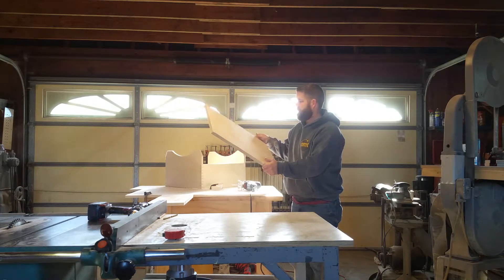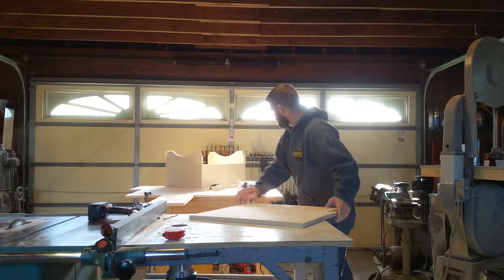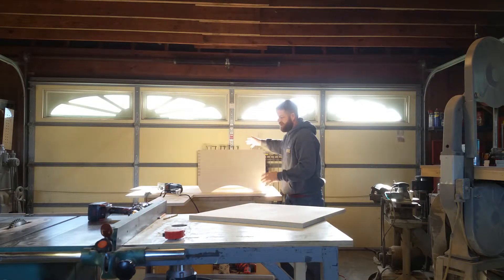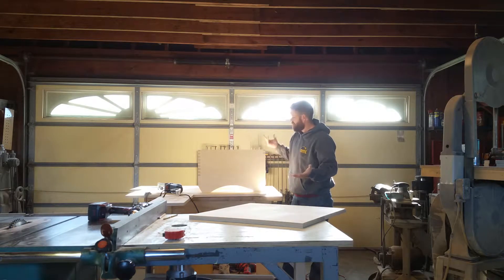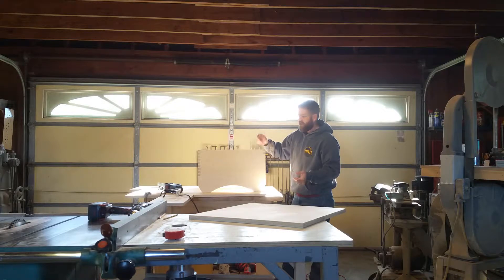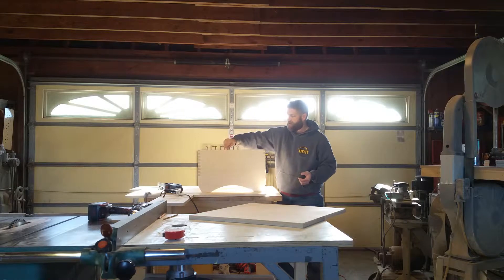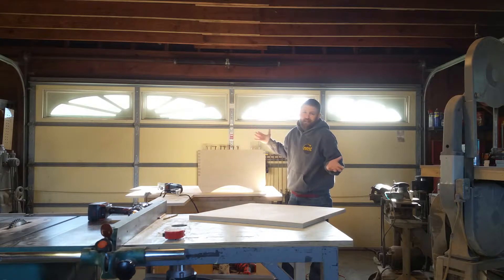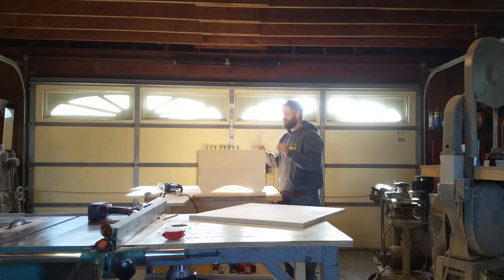There we have the bottom of our ground board. Now what we'll do is glue it up. I haven't taken the time to adjust the clamps or anything because after we glue this we just throw maybe four clamps on it, let it begin to sit, and then I'm going to put two, four, six, eight wood screws through it — because the bottom is going to be covered up with formica, so nobody would ever see those screws anyway, and it gives us a huge mechanical advantage with a screwed-and-glued joint.